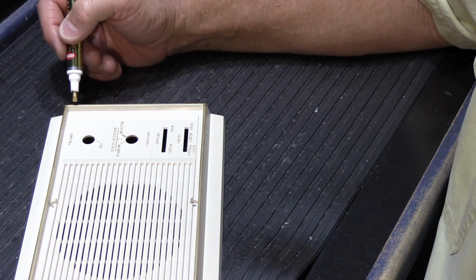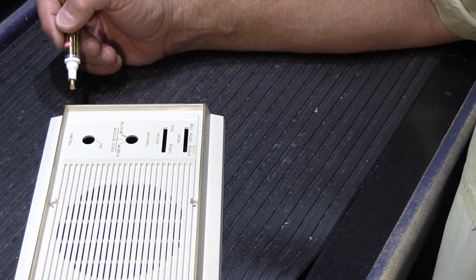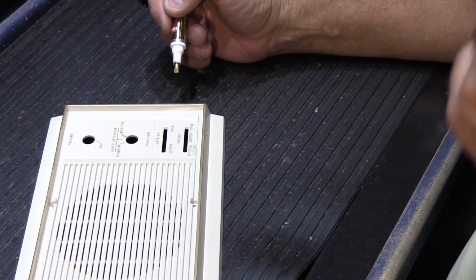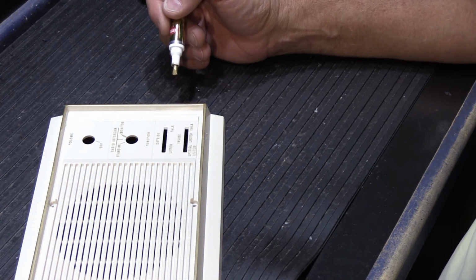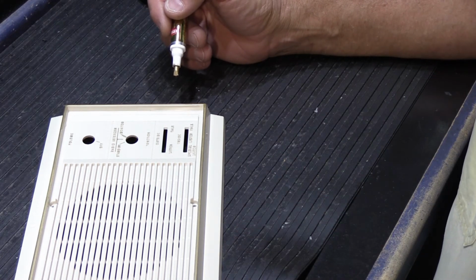When you do a large flat edge like this, oftentimes it comes out much better if you do 2 coats. And the second coat will make up for the thin spots. But if you're going to do 2 coats, what you have to know is you have to let this dry for at least 24 hours.